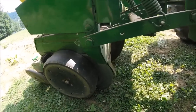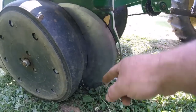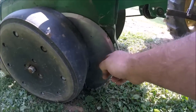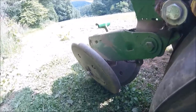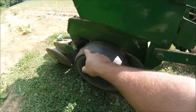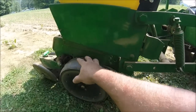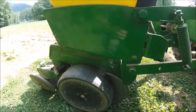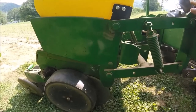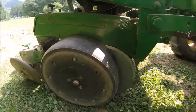Here are your openers — they create the opening for the seed to go into. These are your gauge wheels, and they also firm the side of the trench. These are your covering or closing wheels, and they have adjustments. Seed comes out of your seed box, goes through your meter, down your seed tube, and is dropped in the trench made by the openers. The gauge wheels create the sidewalls and the closing wheels cover it up.